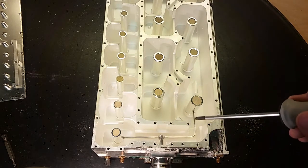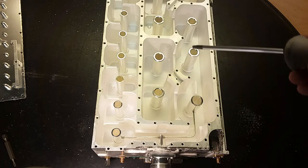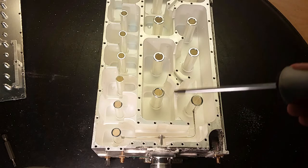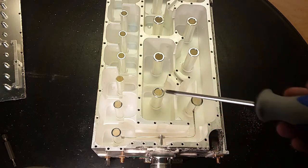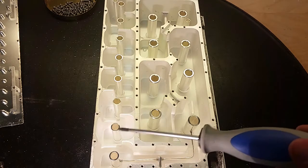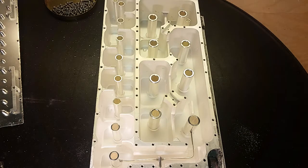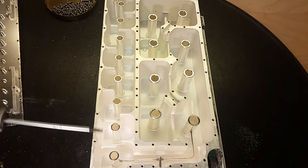So with the antenna coming in here, it goes all the way to this, and this converts it from a coaxial wire to a waveguide. And somehow the length between these poles will work like inductors. And I assume that these parts, you can see one like them that are here, will work as a capacitor. So this is actually a resonance circuit all the way. So this will work like an LC filter, because we got an inductor and a capacitor, and we got 1, 2, 3, 4, 5, 6, 7, 8 steps. So this is an 8th order filter. Maybe, I don't know, but it looks like that. It's filtering 8 times, inductor and capacitor and so on.